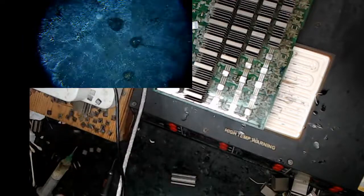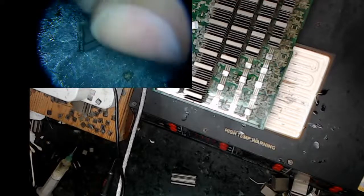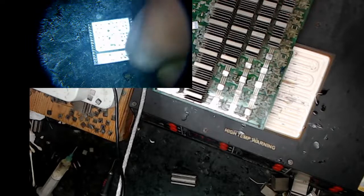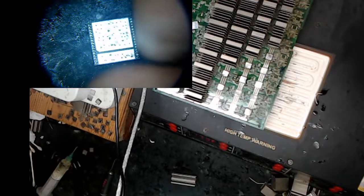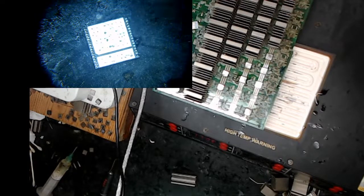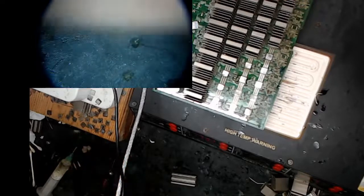which is easier because you never wonder. I tested these. When I use a used chip, there's a couple tests I do on them. One is I check the resistance from the ground pad to the top of the chip, and that typically should be under about 150 ohms. If it's really high, your chip's no good. And then I run 1.42 volts here, and I watch the draw on my power supply, and it needs to do a gradual draw that's fairly quick, but not really fast. Some chips will shoot up to huge amounts of current draw. Some will not draw at all and be really slow. I reject those, and the normal chips will just have a steady increase in draw and amperage, and that's how I test these chips. So I get rid of a lot, just because.